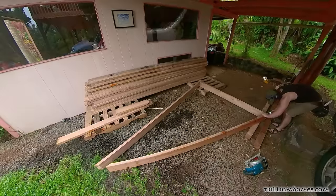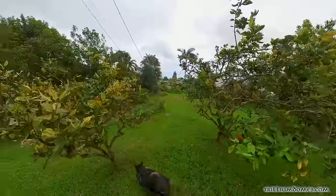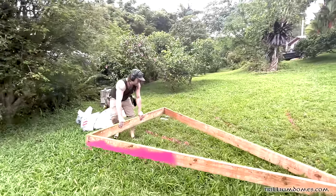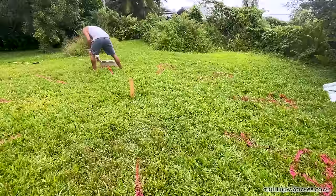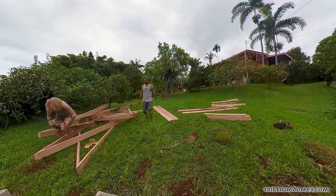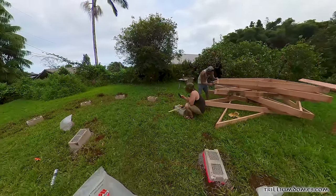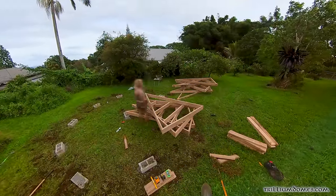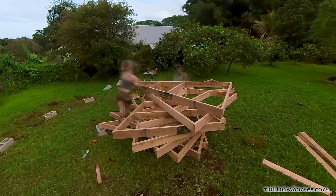This method is also pretty nice for marking post hole locations. Since we were just digging holes, filling them with gravel, and setting blocks, it was easy to find their location using one pizza slice on a pivot from the center. After the holes are filled with gravel and tamped down, we put blocks on there, filled those with gravel, and while the crew was putting together the pizza slices, I was taking block elevations to calculate post height. We used GRK structural screws to frame the joists in.